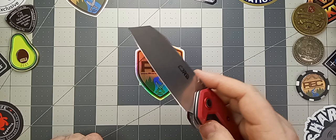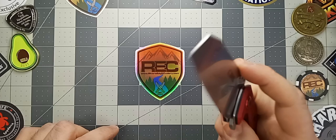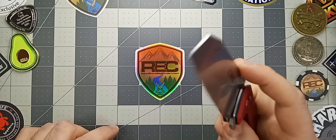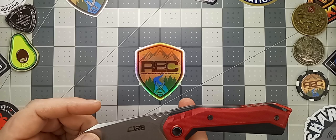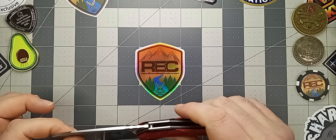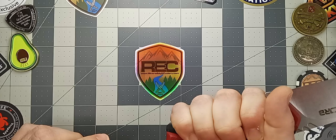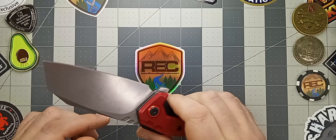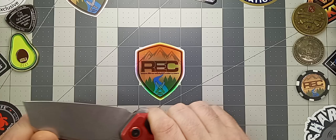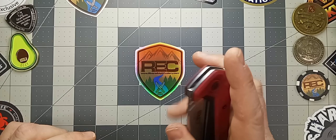The disengagement is pretty easy as well. This liner lock — there's no cutout on the handle, but the liner lock comes up just a little bit, just enough for you to be able to disengage the blade. The balance on this guy is maybe a little butt-heavy — a little further past the pivot than I'd like — but it doesn't affect the way the knife works. It's still pretty well balanced. The ergos are very, very good. There's no finger choil, there is a sharpening choil, but you've got plenty of handle — you can get a full forefinger grip with no problem. You can't really choke up or choke back on it at all, but it's pretty comfortable. There's no jimping, but the cutouts here help a little bit with stopping your thumb from moving up and down. It could have used a little jimping, but that's not the end of the world. This is a liner lock on stainless steel liners, and those are skeletonized, saving a little bit of weight.